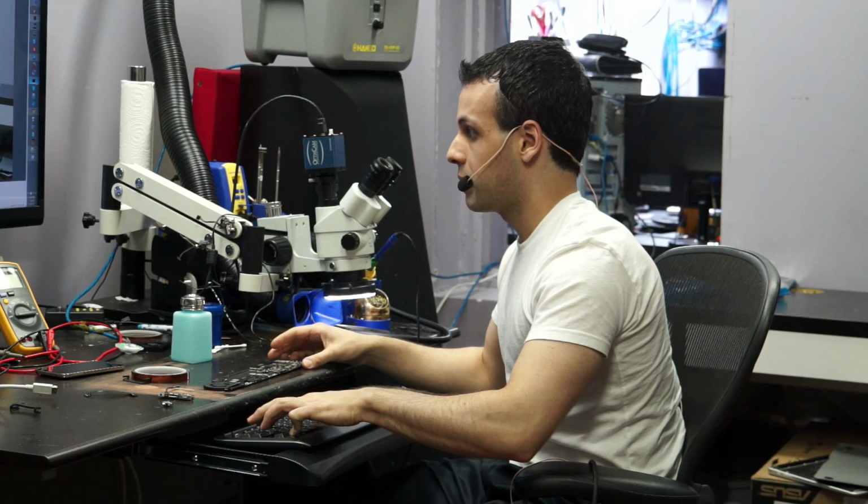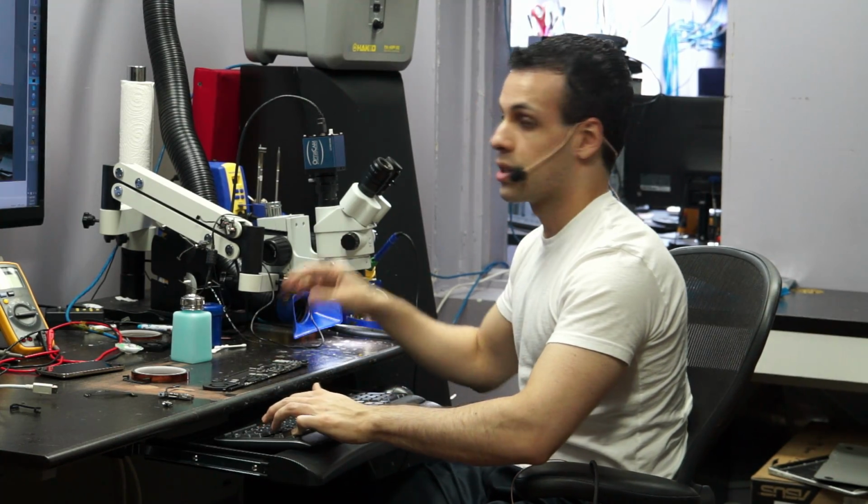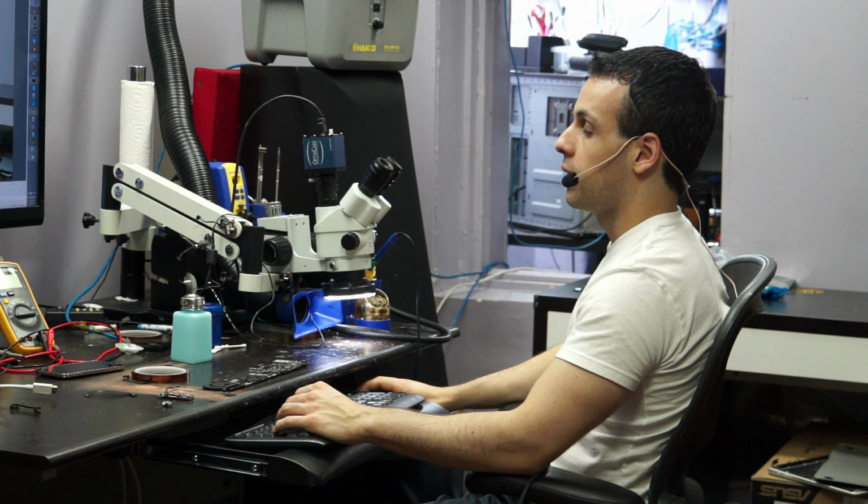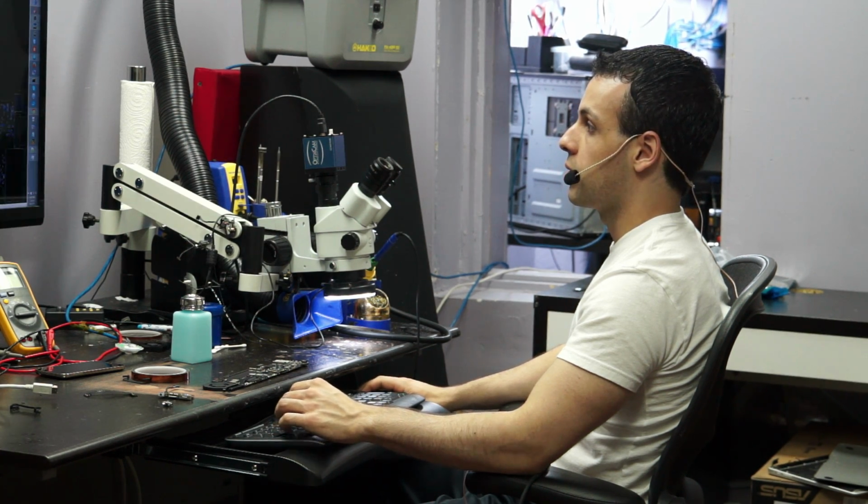So anyway, what I wound up doing here to make this work is I scraped away where that resistor was, where that was messed up, so let me just show you that here on the board view software. Let me open up the board view software and switch it over so that you could see what I'm talking about. As I said, the problem was that this chip was not being told to turn on, and the area just kind of looked bad. Let's just find the chip.